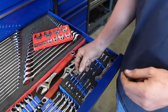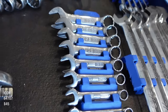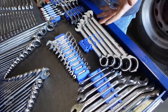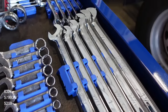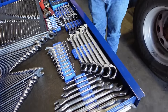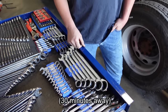Do you like these Icon stubbies? Yeah — I bought these and then like two weeks later I bought the bigger ones on the wall because those go to an inch and they get used a lot more. And these are Icon large ratchet wrenches. I always wished they made a ratchet set in inch and a quarter or inch and a sixteenth, and then I was at Harbor Freight one day and saw this. They're reversible too. The one thing I didn't like — it skips 15/16 and that's a very common size for trucks.